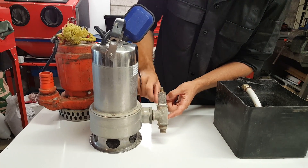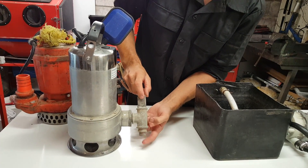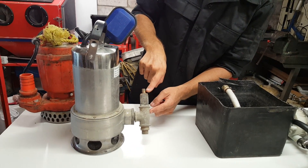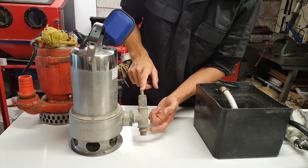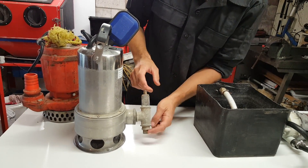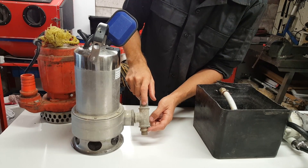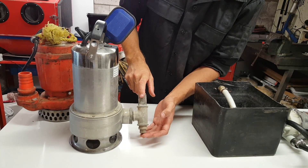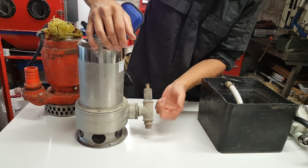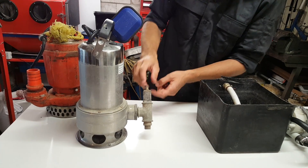On the side here I've reduced down — I think it's about 40mm coming down to 15mm or half inch. On the bottom I've got one size nozzle that starts the circulation running in the reservoir, and on the other side I've got the outlet that goes up to the handpiece, which is slightly smaller. Depending on what size handpiece and nozzle you're using, your plumbing, and the shape of your reservoir, this will change your pump power and flow rate. So you have to mess around with these to try and get your ratio right.